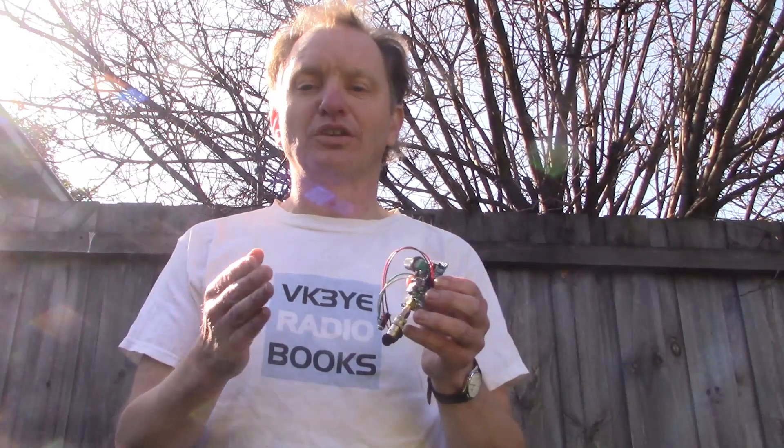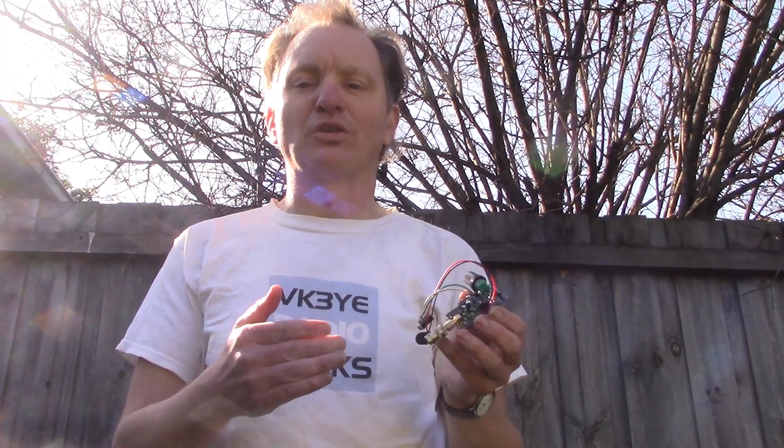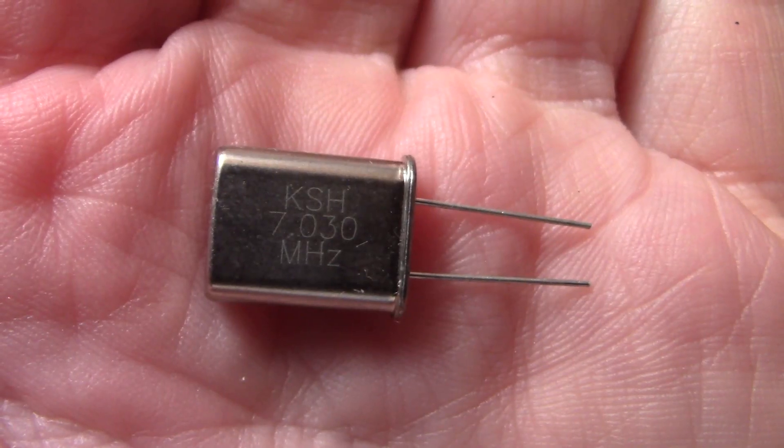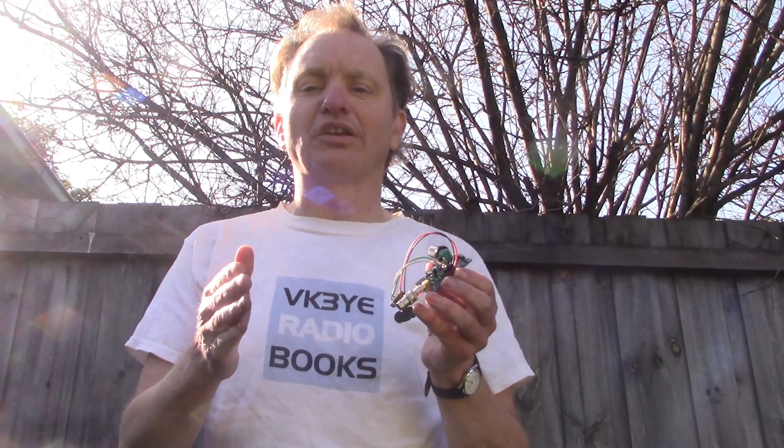7.030 is like an international frequency that QRP is often used on. It's desirable that it be available all around the world for CW, so that we can work DX CW-to-CW QRP contacts. Plus, you can get crystals for 7.030, as you can with 7.023. In the case of 7.023, yes, it is slightly below 7.025 where they intend to draw the line, but these Pixies have a pretty broad receiver, so a digital or other signal on 7.026 or whatever would make rigs like this almost unusable.